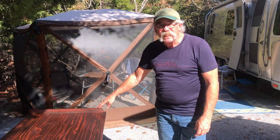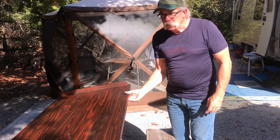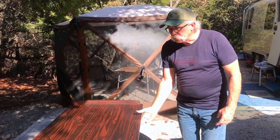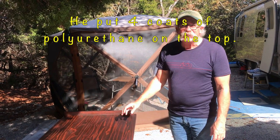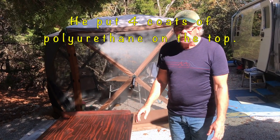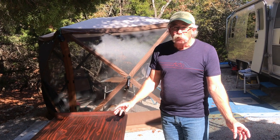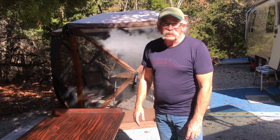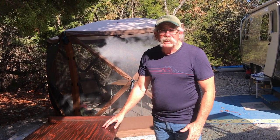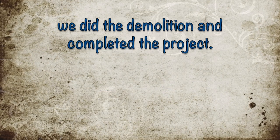I glued a little piece on the edge and stained it yesterday. I put two coats of polyurethane on the back - one last night, one this morning. This is the first coat on the top. It's kind of hard doing it at the campground when you have a garage and controlled environment - it's nice. Luckily we've got about three days of nice weather. I'm hoping to get four coats on this and it's a fast-drying product, but it needs four to five hours between coats, and in the mornings it's chilly, so it's going to be interesting.